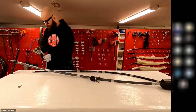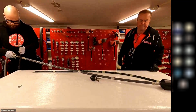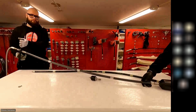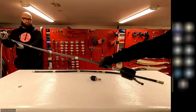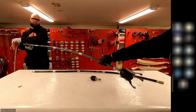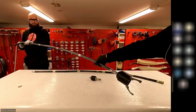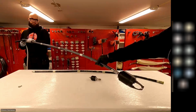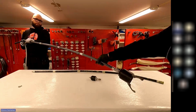If any of you have used or tried to rotate something with the more standard push rods, if they don't actually twist and have damage, you'll get that kind of springy effect where you try to turn a little bit, nothing happens, it builds up because of friction, then turns 3 inches or 6 inches when you only wanted to turn a quarter. That definitely doesn't happen with these. They're super strong rotationally while still being super flexible to go through bends.